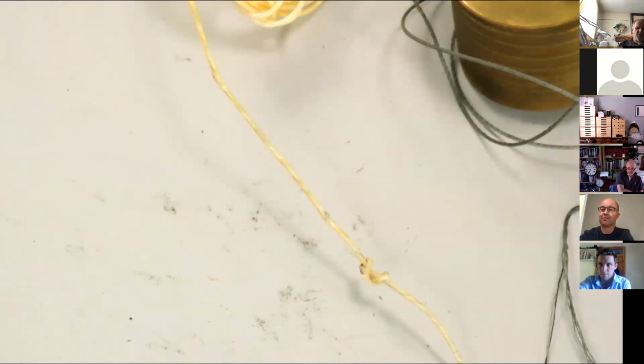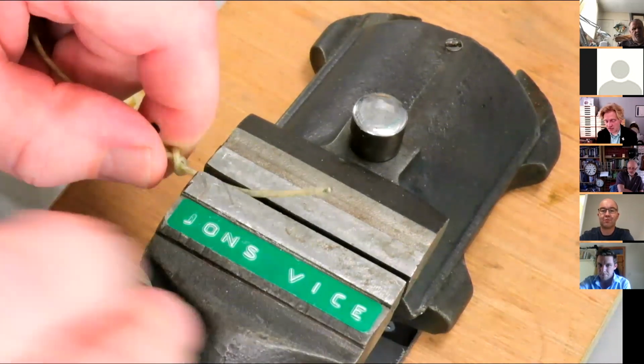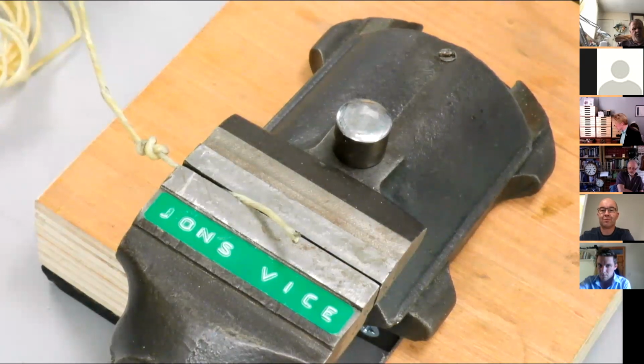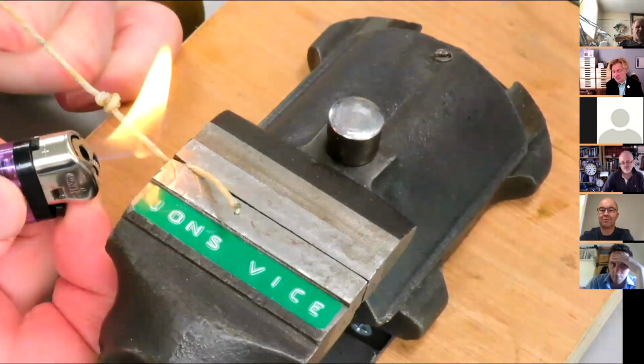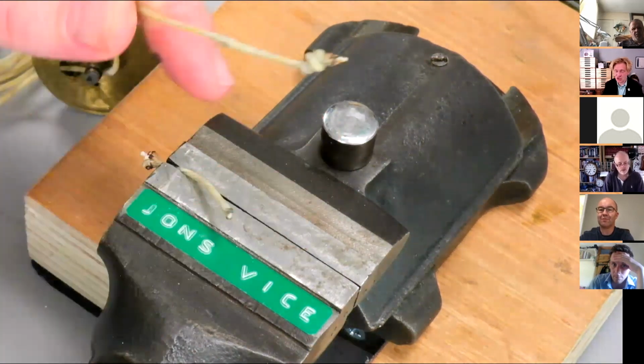So I'll take my gloves off because we're going to get the vice out here. Like on a long case clock, I made a video about it. It's on the YouTube channel. When you do the knot, pull it tight, get a pair of smooth jawed pliers, pull it really tight, and then don't cut the line, break it by burning. With this natural gut, that causes the fibers to contract. So when the knot is finished, there's a nice bulbous bit here, which helps it not pull through.